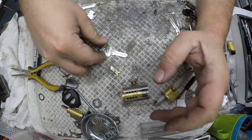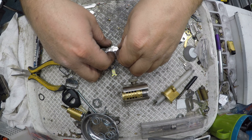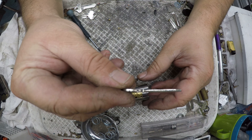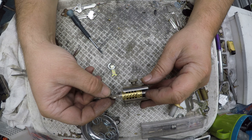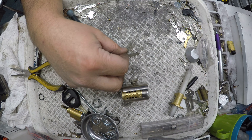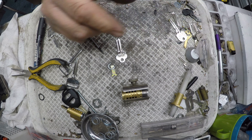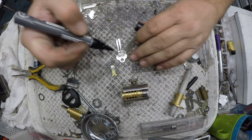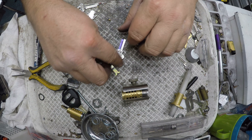I'm going to use a cylinder cradle here because I don't want anything to fall over. So I could pre-mark my keys, but I don't. I've just got myself a blank key. So I'm just going to pop that in and see if the profile is right. Now what I'm going to do is quickly score my key so that I can find my spacing — I'm just going to mark, just put a texture on it.